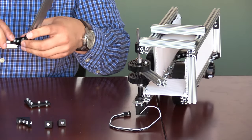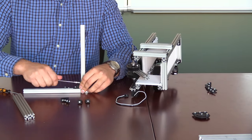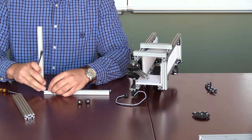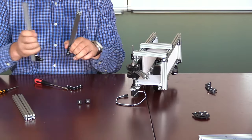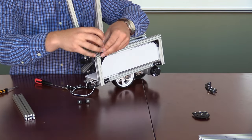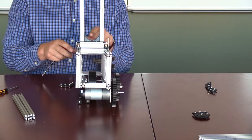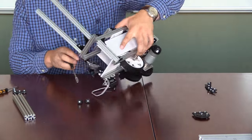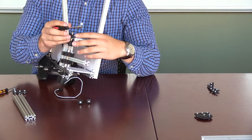For the next phase, you will need four of the 22.5 cm pieces of extrusion, the two corner brackets, two lap brackets, a 90 degree bracket, and a 4 cm piece of extrusion. We will attach the two corner brackets to the base of the 22.5 cm extrusion, then we will slide them onto the back-mounted extrusion piece on the top of the shooter, taking special care to make sure that the pieces are centered and that the two corner brackets are touching one another. This will be important for keeping the ball inside the shooter.